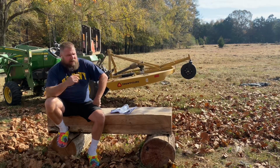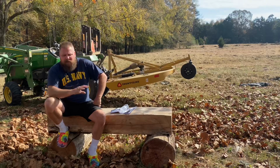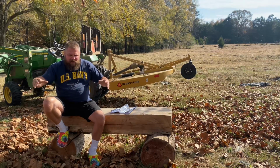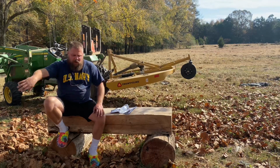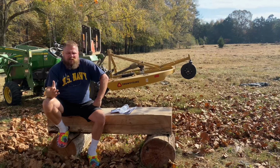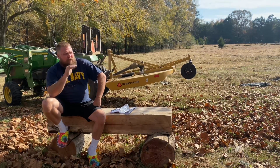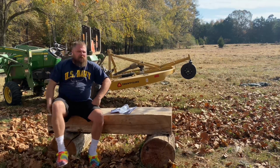And I don't think it's so much the machine can't handle it. It's cutting it underneath, but it just can't discharge it out. You wind up with this big ball underneath, and what happens, all of a sudden the deck will bounce up over it and shoot it out the back. Just not an ideal situation, obviously. So I just found in the really, really extreme tall stuff, you just go a little bit slower. No different than if you're using a push mower.